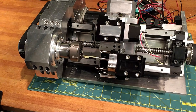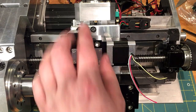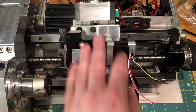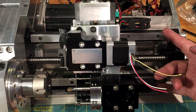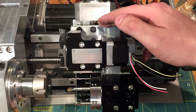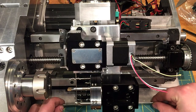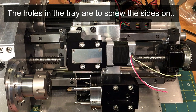This machine is one horsepower. I'm going to make different spindles for it. It's got two tool turrets — one for drills and one for turning tools. Both of those are stepper motor driven and I'm going to write the plug-ins for those, hoping to integrate them with the Masso controller when I get it. It's got linear guideways on X and Z, a ball screw on Z and a precision lead screw on X — that was just a size constraint. It's got ClearPath servos on both axes, and a tray down here for chips, like a toaster oven, but cooler.